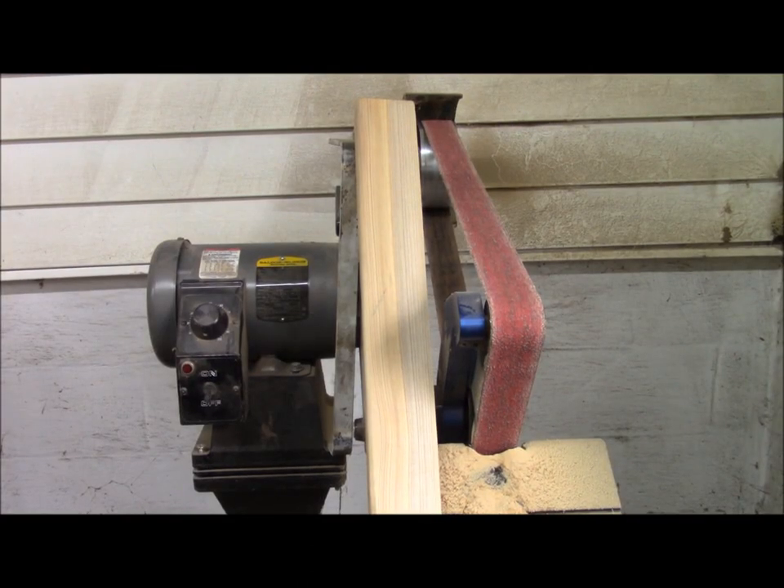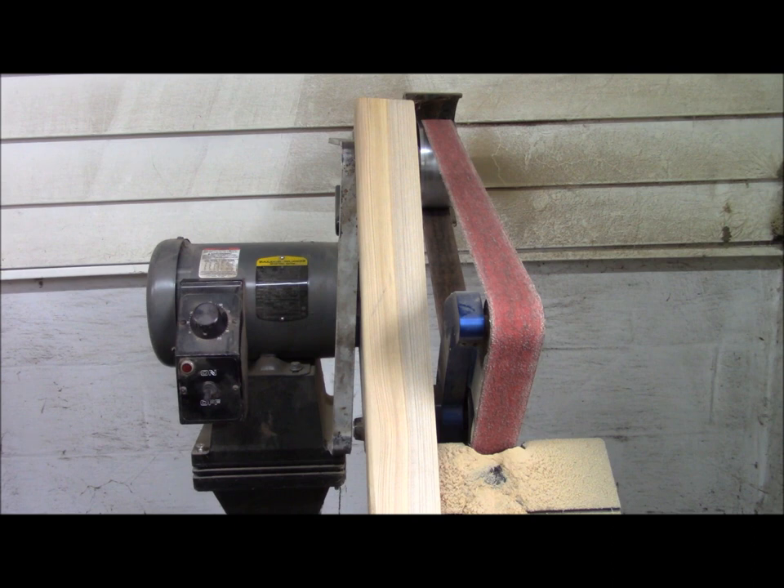We removed a fair amount of wood from our plank, which turns out to be about a number three grade wood. This was the sapwood of the old southern pine — it still contains some heart pine streaks. You can see one scar about midway in the plank; it runs diagonal a little bit. I could grind that out, but that would take another 15 minutes and I'm not going to bother. If you had a planer, one pass would clean up the wood pretty well, but I don't happen to have one. We're going to leave that as it is.